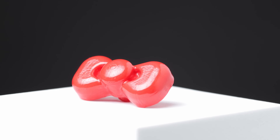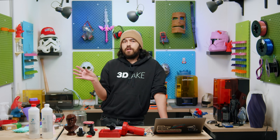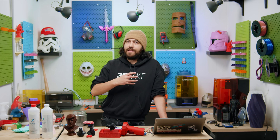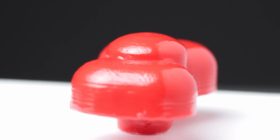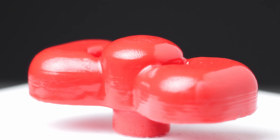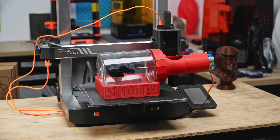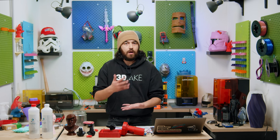The wait time required for smoothing depends on the ABS you use. For our ABS, it is relatively slow acting — that doesn't sound good, but it's actually the best because you'll be able to see when your part is done perfectly and not become a big melted mess. The acetone will get rid of layer lines, but if you use a high enough layer height it won't do this effectively, especially on dome-like parts. So print with low layer heights. If you really want to speed things up, I have seen people put their setups on a heated bed turned up to just a little above room temperature. I'm a bit uncomfortable with this method because of safety concerns, but if you do this, please don't leave it unattended, do it outside, and keep flammable children away.